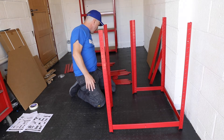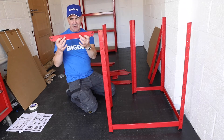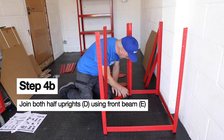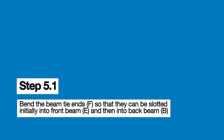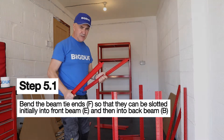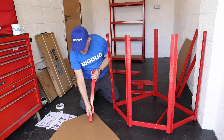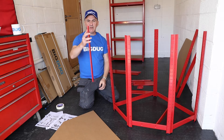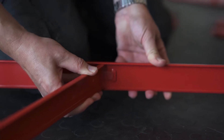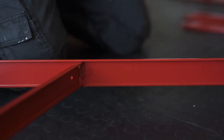And that's that done. The front beam is the one with two slots here — this should actually make the whole thing stable in order to build the second part. The most important thing is that the support beams have to go in before we continue. The first one 90 degrees, the second one slightly bent in at about 45 degrees. Putting the first one in like so, and slide it along where the slot is.